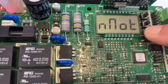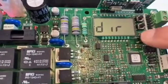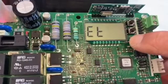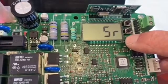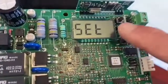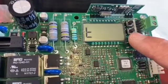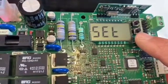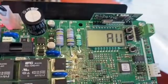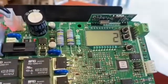For number of motors, I've disabled the other motor so I'll take it down to one arm only activated and hit OK. Direction of travel — the internal preset is always SR, semi-residential. Click to open, click to close — program all of that in and don't touch anything else. Finally, hit OK to perform an auto-set. The unit will count down three, two, one and the gate will begin to close and open on its own. Don't disrupt it. Hopefully this video has helped — thanks for watching, any questions please post them.